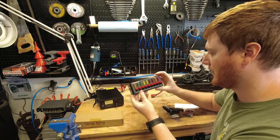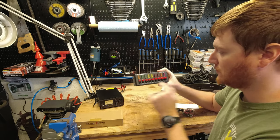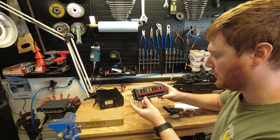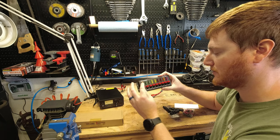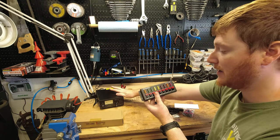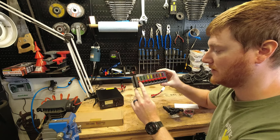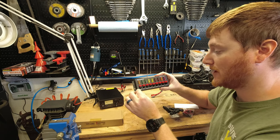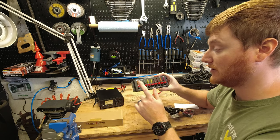These things are so cool — simplistic but functional. It's just a nice metal case with two screw holes on either side, so if you wanted to mount it on top of a bench or onto a wall, no problem. You have a single DC input port which connects to your power supply. These are rated for up to 40 amps. I have a 30-amp power supply, so I'll put a 30-amp fuse on it. Then you have eight output ports, each individually fused, which is great.